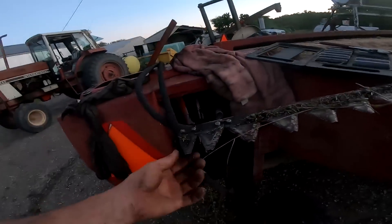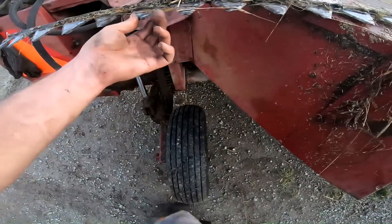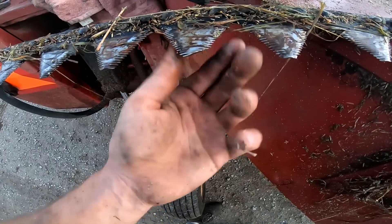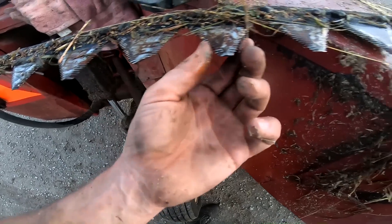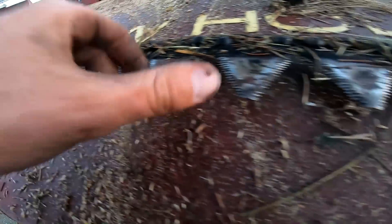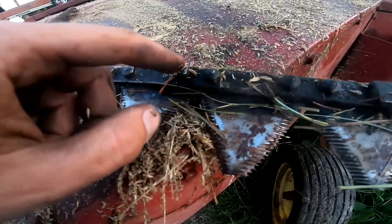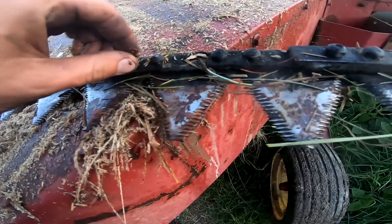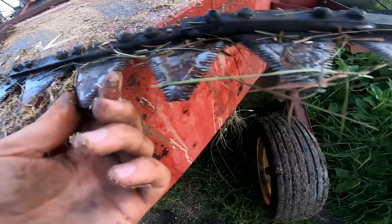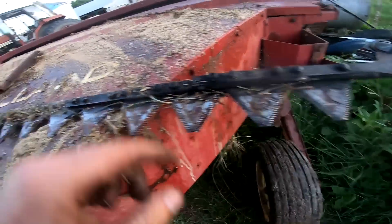It's another thing I like to look at. We just replaced a bunch of these, but since it's out again I'll go through and check all the serrations. This one's missing the tip, but it's still sharp, so I'll be stingy with blades. Usually before second cut I'll go through and really replace all of these. These are nice having the nuts. That one's coming loose — that's not good at all. Good thing we had to take this loose; we'll tighten that up and replace this one.